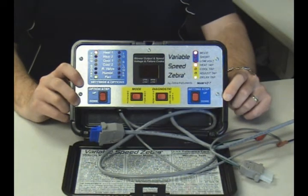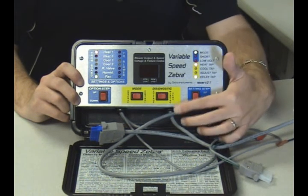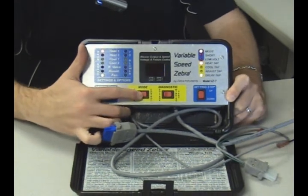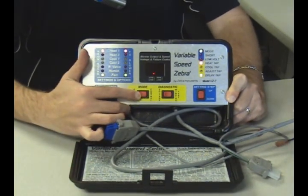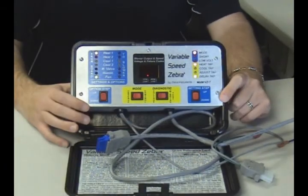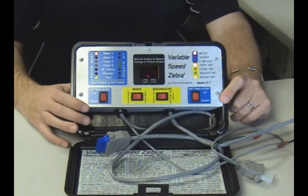You now use your VZ7 just like usual to determine exactly what is happening in your system. Is the condenser circuit board providing at least 24 volts to run the signal functions? Do a voltage test. Are there proper signals coming down the heat 1 and heat 2 lines when the system is operating and the fan should be on? Use observe mode. Can I start and run the motor in both of its speeds? Use control mode. If the motor does not operate in any mode and 240 volt AC power is confirmed at the motor's power terminals, which section is at fault — the electronics module or the winding section? Do a winding test.